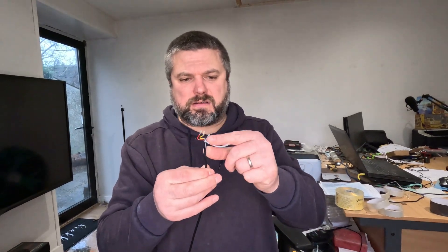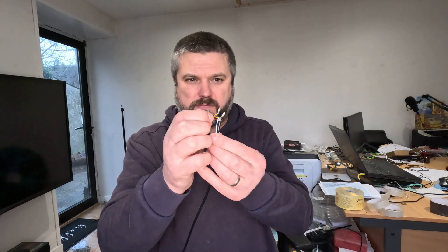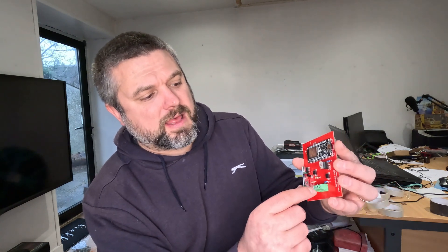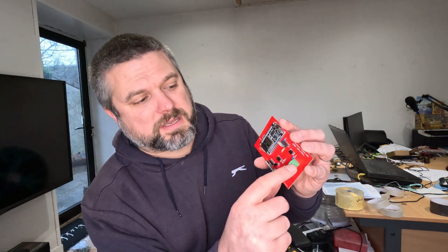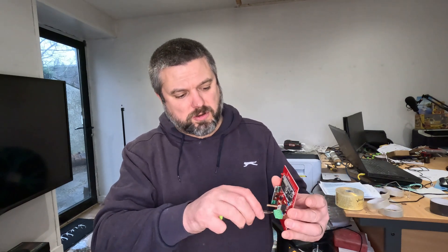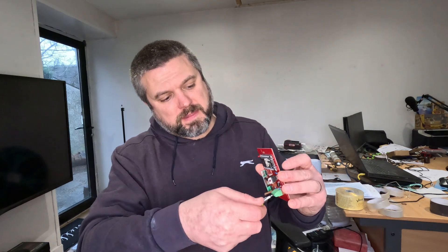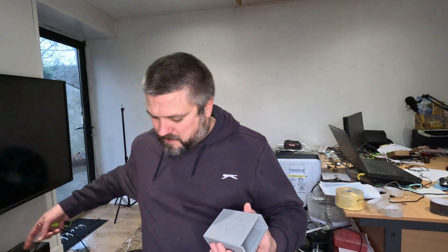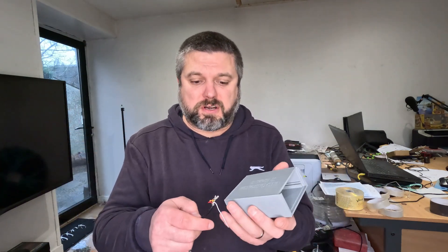Setting up is fairly easy. This is my sort of test bed wiring — I've got positive, data, and the screen cable which acts as negative. Looking at the board with the aerial down at the bottom left, the closest connector to that side is positive, the middle one is data, and the one at the top is neutral/negative. Using the easy screw-in terminals at the top, just open them out. One thing to make sure — switch it off before you start, because you don't want to short wires. Make sure all your power is turned off before you attempt this.